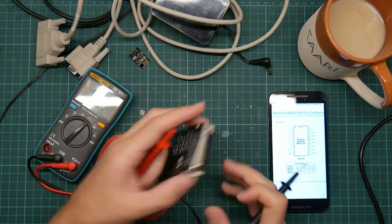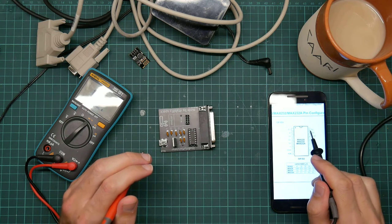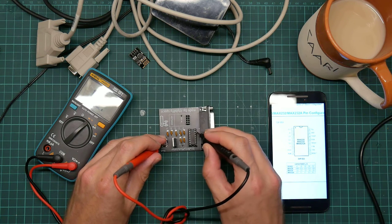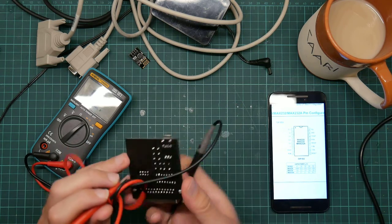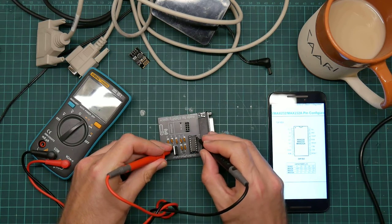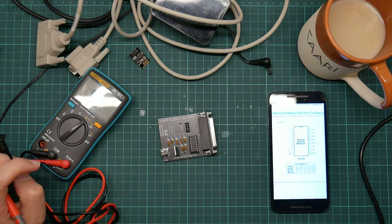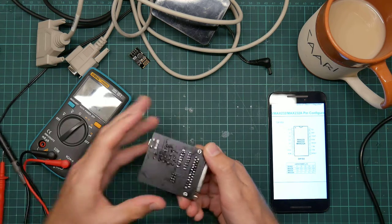Okay, we've got the pinout. In fact, the pinout's from this angle. So it's not using the standard layout, so VCC and ground are pin 16 and 15, so yep, that's connected. And power is the middle pin of the regulator. That's here too, yep. So that suggests that the Max 232 is properly hooked up. So, interesting. What else could be wrong?